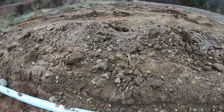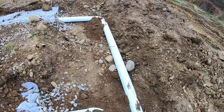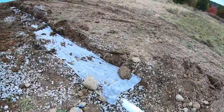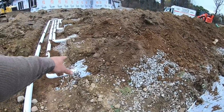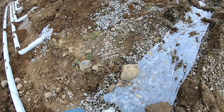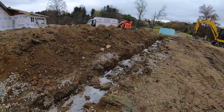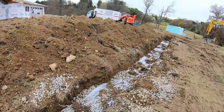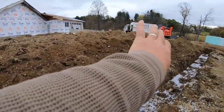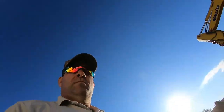Bed everything in pea stone and sand or dirt, you know, just fine dirt. This is the last one and I'll leave that open. You only need to leave each end starting point here, and he puts a stick on there, and then the end how I have on each, and then he could adjust them all. But this last one, because I swap the dirt over, stays open. Then I take the dozer and push everything from here over this and cover the whole system after it's inspected.